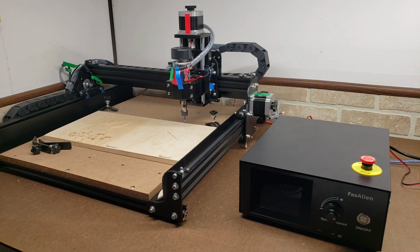I really admire the belt drive system on here. It's got a great system for engaging the maximal amount of teeth on the sprockets for the stepper motors. It's got tensioners at the ends of the belt so you can adjust proper tension. The roller wheels themselves have bolts that adjust their tension. There's definitely improvement to be made in the roller wheel tensioning system, but the way it is works very well. You just have to be a little bit more patient with it.